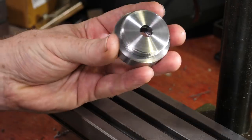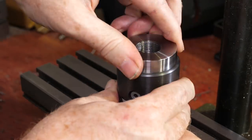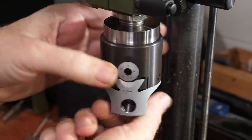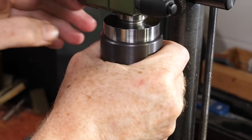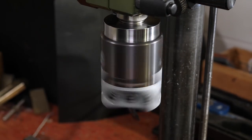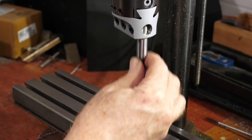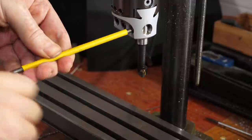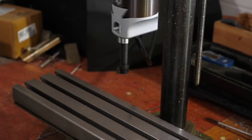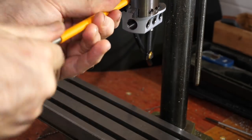The arbor was done, and I couldn't wait to try it out on the mill. The thread engages cleanly with the boring head and tightens it snugly against the shoulder. It then threads onto the spindle - as intended, the bottom of the spindle tightens against the face at the bottom of the hole, keeping the arbor steady. The whole assembly spins just fine when everything is on centre, but with a new boring bar fitted and the weight offset, there is clearly a lot more vibration.